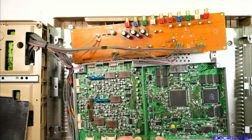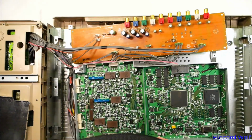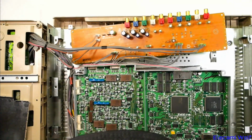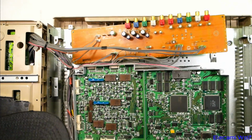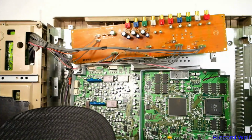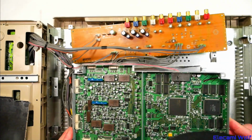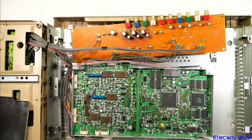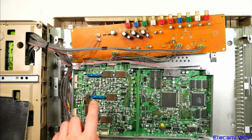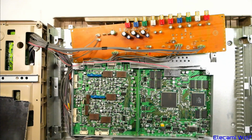There's a lot of surface mount electrolytic capacitors here. They all look okay. I couldn't smell anything, but electrolytic capacitors from that age have a tendency to go dodgy. So there's a possibility that there's something dodgy in there, which is causing those problems that we saw. Maybe, it's difficult to know because the pass-through component video looked fine, but I don't know how far it goes. In theory it should go the whole way through the TBC and then back out, which might suggest there's a head issue.